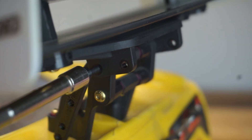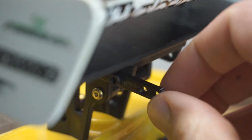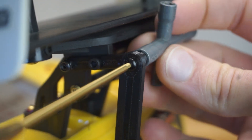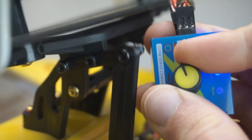All this lever really does is extend the mounting point for the vertical servo linkage on the wing a little bit further outwards so that there's more leverage on the wing — and that just made a huge difference. It works so much better now.